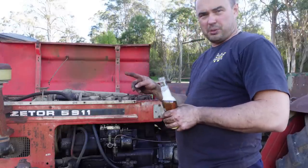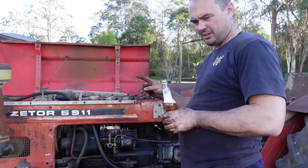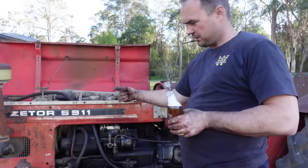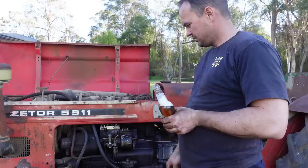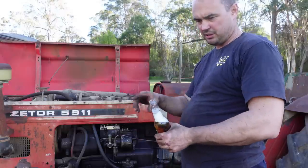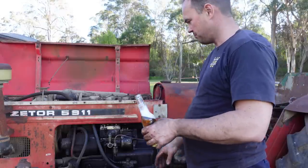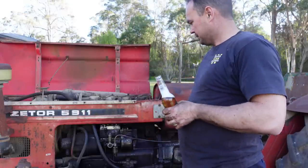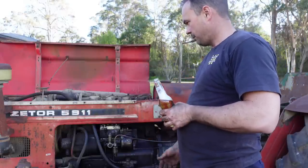but that muffler I just pulled off, the three cylinder one, the pipe part had a different angle on it and the bolt spacings were different, so I think I'll have to buy an exhaust, I think it's 2 inch or something, like a donut, and then you can cut your own angle, so I'll make one up on her. But we might give her a go now.